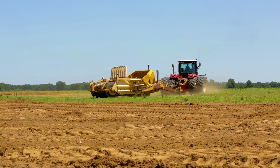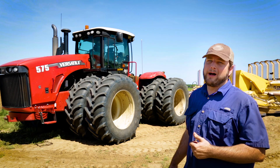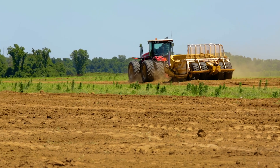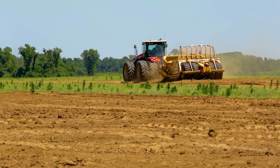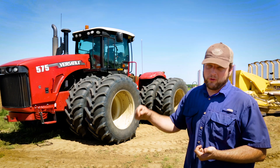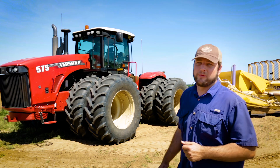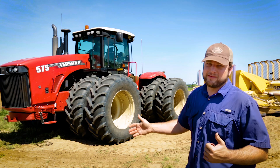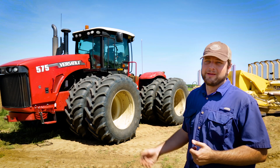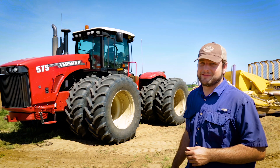I actually like, for our application, the outboard planetary axles. I feel like in a real high horsepower, high draft application where you do have rear end issues or troubles, with inboard planetaries it's a disaster when you have an issue because everything's tied together. That was my problem with my 9630 — the inboard planetary goes out, it dumps on the rear end and takes your whole rear end out. Whereas with this, you just replace the planetary. Back to the simplicity: all the systems aren't tied together, so if you have a hydraulic pump go out, it doesn't get in your rear ends and get everywhere else.